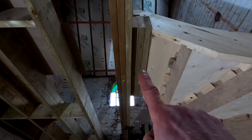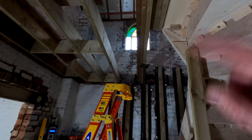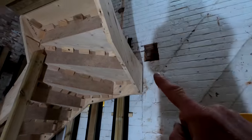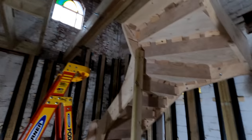Pete and Joe have had to extend this further out as well just to make sure we've got enough clearance, because it was pretty tight. The last thing we wanted was to get everything in and then have building control come around and say we've got to move it. So we've extended that a bit further over. You can see we've got a triple joist in here now — that's just temporarily fixed and it's in the pocket there. We just need to make sure everything's level. Joe has the pocket out there and the double trimmer is sat there ready to go in. We just need to get a hanger on here, trim that across, fill these joists in here, and that frees the floor space upstairs ready for flooring.